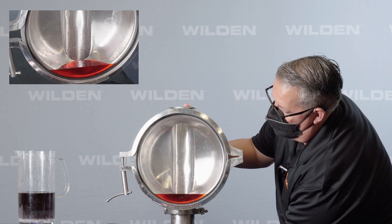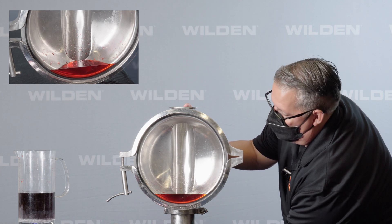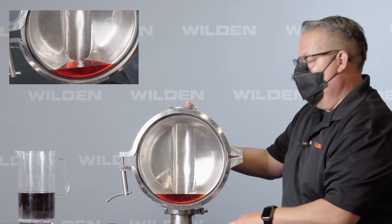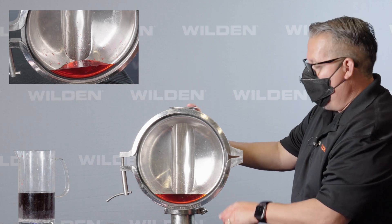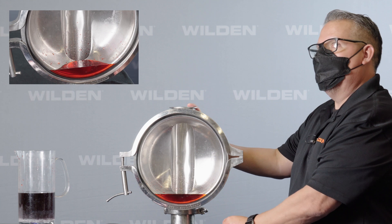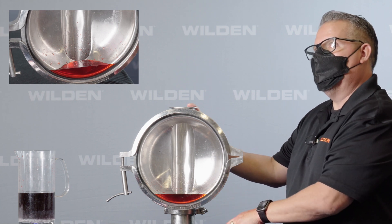As you can hear, no more fluid comes out — it's fully drained from the check valve. But the liquid chamber still has quite a bit of product left in it. That remaining product is going to cause bacteria growth and give you contamination from batch A to batch B.